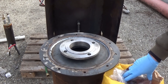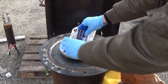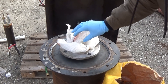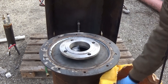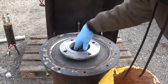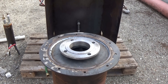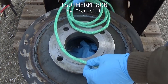As you can see, I am loading the reactor up with waste plastics of any kind except halogenated ones. You can use any kind of waste as long as it is organic, meaning it is made out of hydrocarbons. You can also use damp and wet materials, but this will take a lot more energy because all the water boils off before any thermal cracking happens. I did not load the reactor to the maximum due to my gas bottle being quite empty, but normally you would fill it up so that nothing more fits in there, limiting the amount of air and oxygen present.